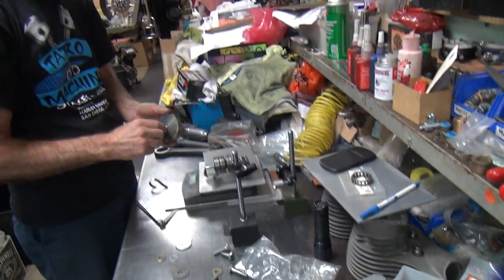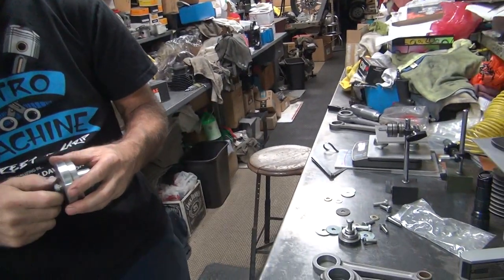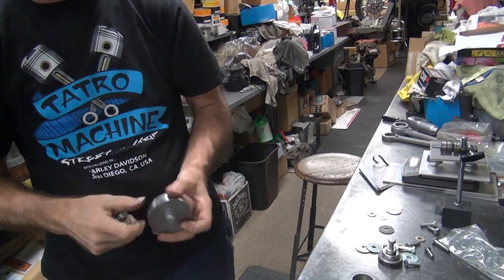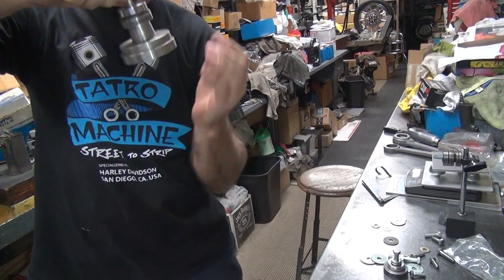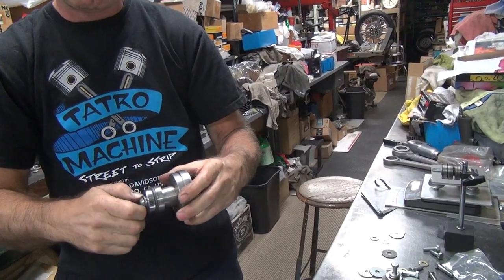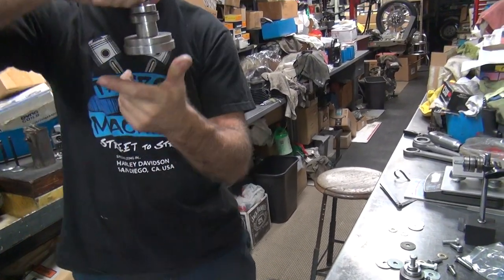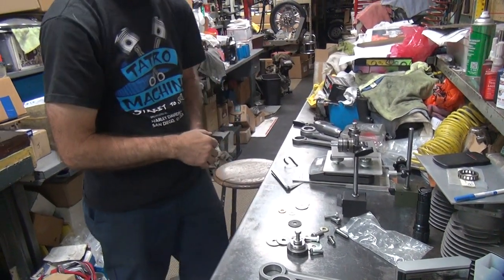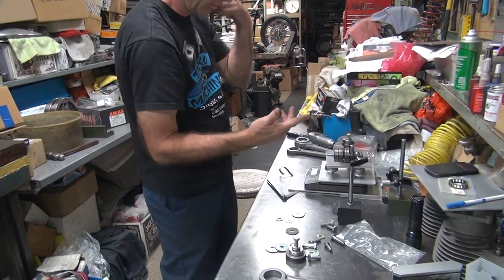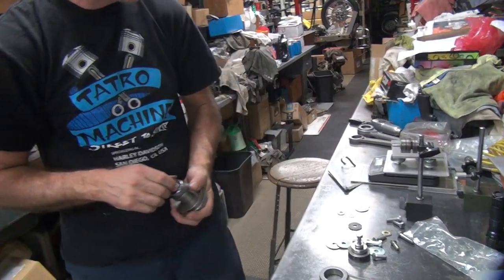We're lucky. Get some bottoms out in the middle, which it might. This will just make it. Perfect. The bolts didn't hit each other in the middle. That'd be a problem. Still 76.5 or 3, I mean, or 76.2. So we're 1/10 light this time. Let's see, everything's over here. I need the other flywheel too.